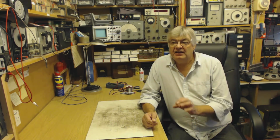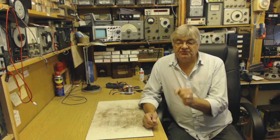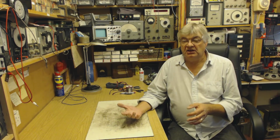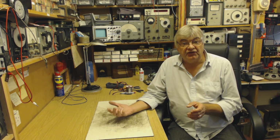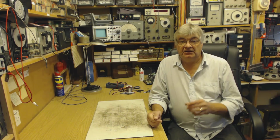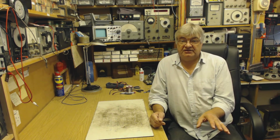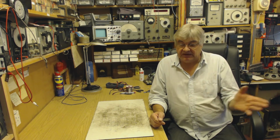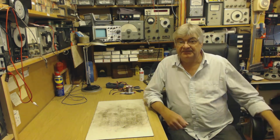complicated stuff like that. Basically, anything coming up the mains in the form of a radio station or a lot of other interference is blocked by the RF choke, but the mains is let through. The capacitor shorts out any RF interference, whereas it doesn't short out the mains, which wouldn't be a good idea.